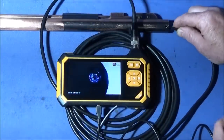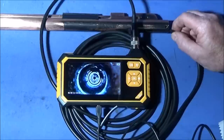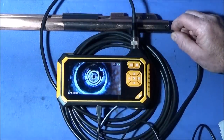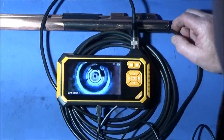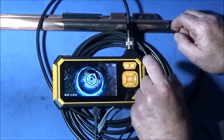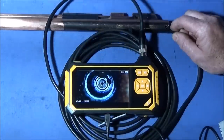And then you can go down further into the actual reservoir, and you can clearly see there the inlet valve, or the inlet seat for the valve, from the pump chamber. So that non-return valve seals on that lip that you can see down at the bottom there. And the actual valve seat looks really good. There's no damage on that one.